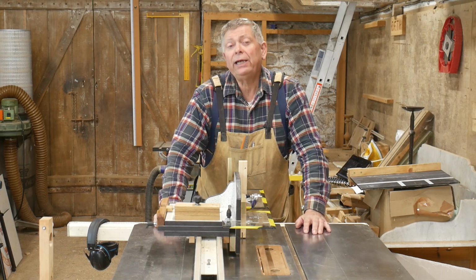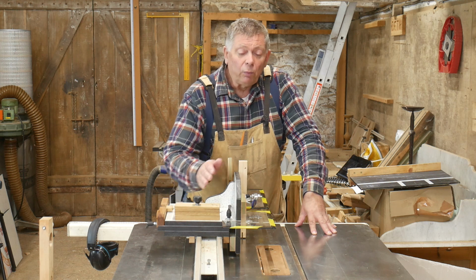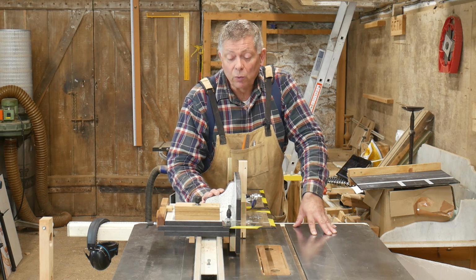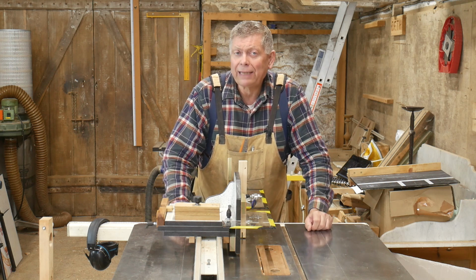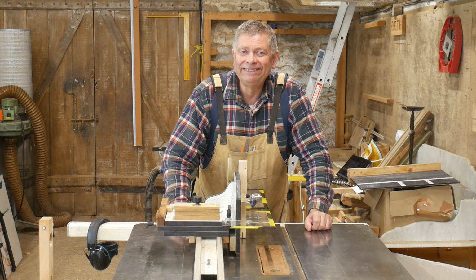The top carriage is an assembly of three pieces. We've got the top layer of the stack. We've got the vertical working face, which carries the workpiece, and this bracket, which keeps the two nice and square. All the joinery is done over on the router table, but there's also some drilling and tapping to do, and that was problematic.